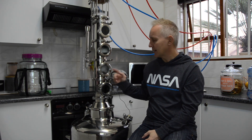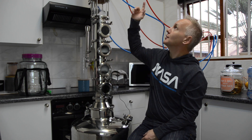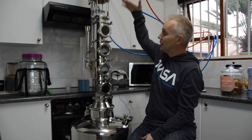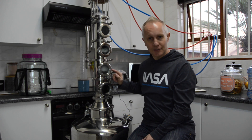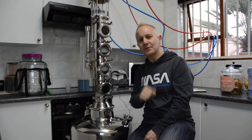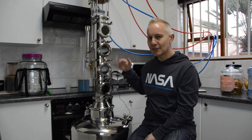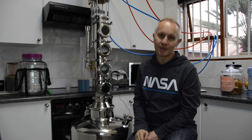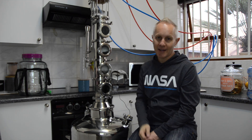Another reason — I can see it's flooding. I have to turn down my power consumption. I've still got the reflux 100% cooling water open, so all the liquid is pushing down at this moment, and I can see it's starting to flood. Go check out one of my previous videos where I talk about handling flooding. I'm going to reduce the power a bit, let it subside, and then start to close on the reflux condenser so that product can start to come out.